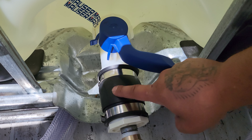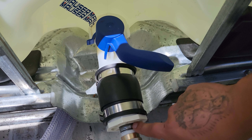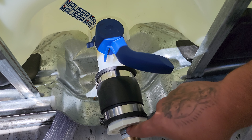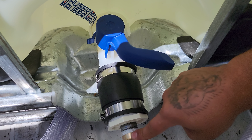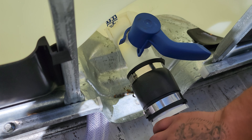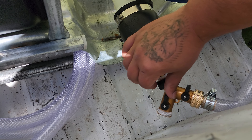It runs into a two-inch PVC reducer down to three-quarter inch, got a galvanized adapter male to male, brass female to male. Then we got a splitter here — this splitter opens up so that way we can run our fill, our buckets, wash our hands.